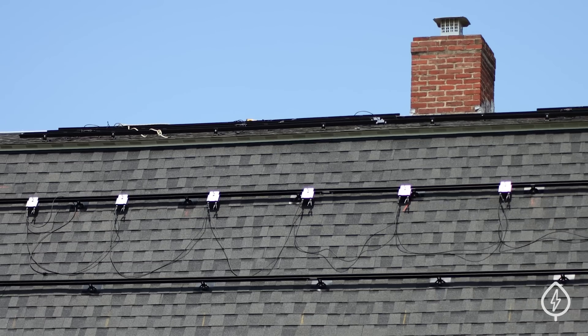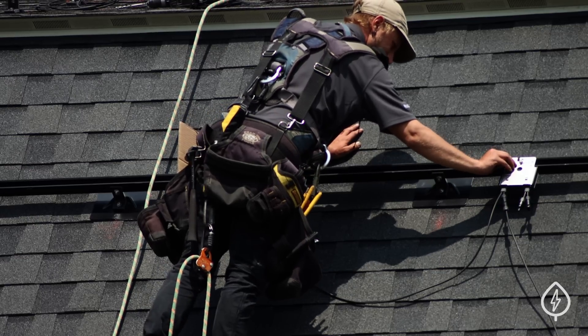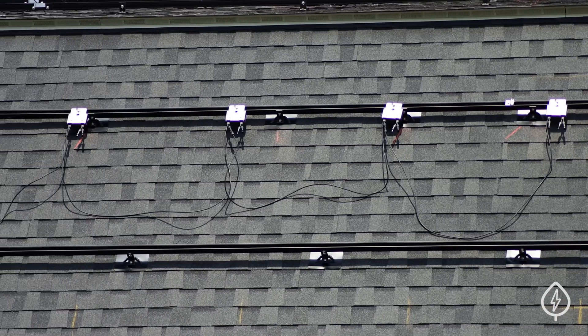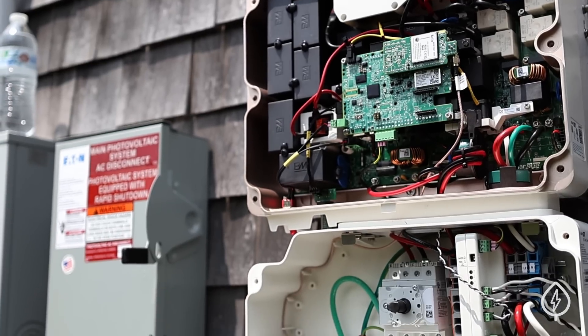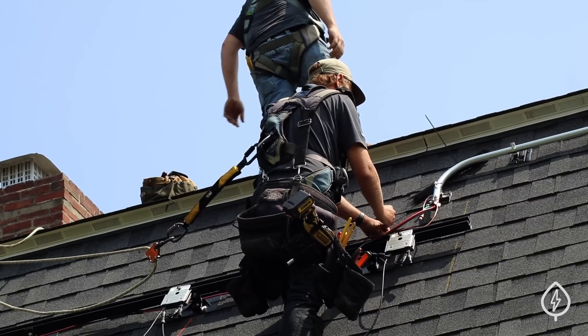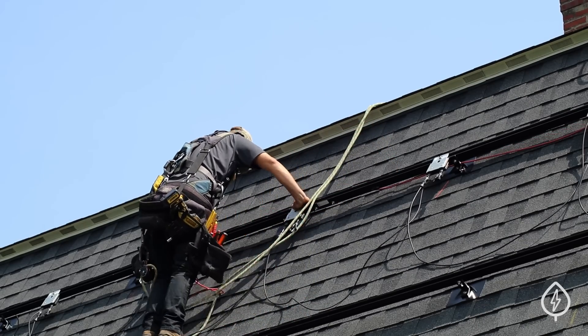So Josh, can you tell us a little bit about the inverters that you installed today? Absolutely. Today we'll be installing a 10k SolarEdge inverter — that's 10 kilowatts on the AC side — and that is paired with 400-watt optimizers on the roof. Each optimizer will go underneath a 400-watt panel. It's a string system, but they're individually optimized, so each panel will produce its own power. What I personally like about this system is that if there happens to be an issue, it's generally localized on one optimizer. The inverter is located on the side of the house, coupled with wires going to the rooftop system where the optimizers live, mounted to the rail under each panel.